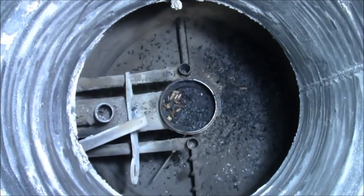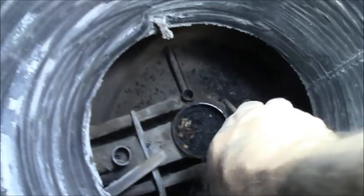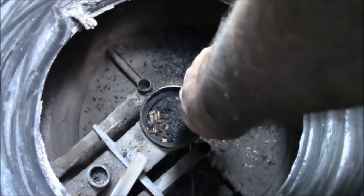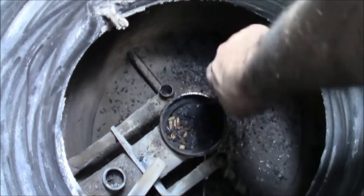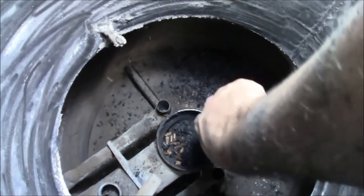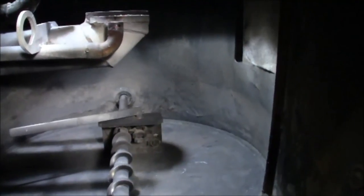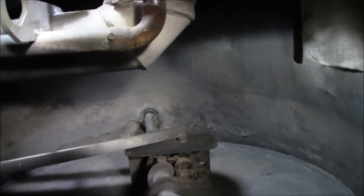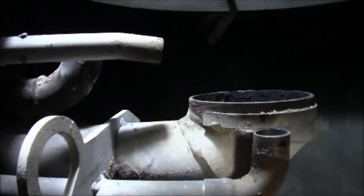Pointing the video camera right down from the top of the boiler to show the sort of activities we're doing here — we are forcing out the clinker with the screwdriver. So here's the burn chamber after a good thorough clean, sweep, and hoovering. As you can see — good as new. Everything exceptionally clean.